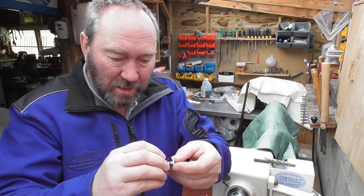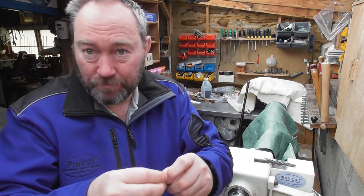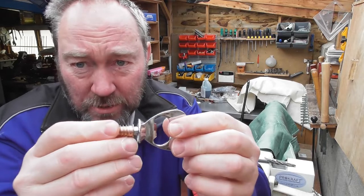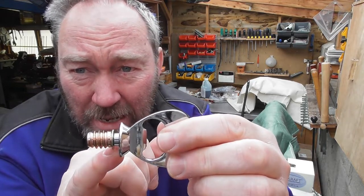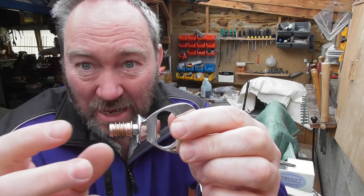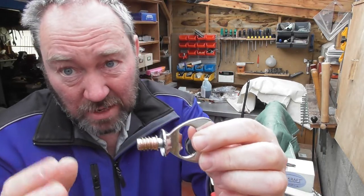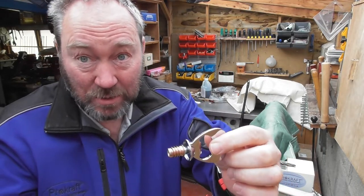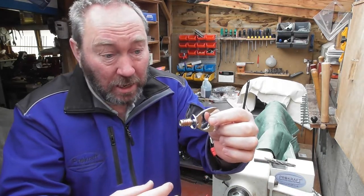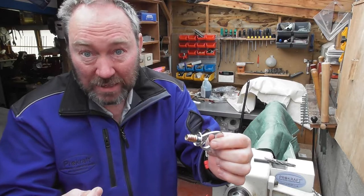However, they are slightly different to some of the others that you'll see, because there's a little lip there which means that the wood insert screw has to actually be inset by about 6 millimeters. It's really not difficult. Once that's in, we can pop it on a mandrel with a mandrel washer that I'm going to be using today, and just turn it as a normal little handle.